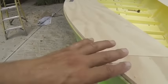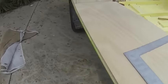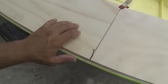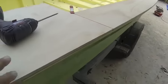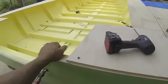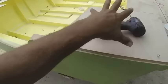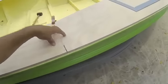I'm setting it back — I laid them on, scribed it out, and just slid them in. I cut my joints and it's pretty even across there; gets a little tight here but that's all right. I'm going to glue that strip on and fair it off. You can see I have not cut my insides yet. There's a little stiffener block for the transom; each one of these seams will get a butt block.